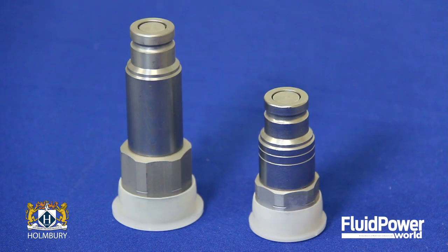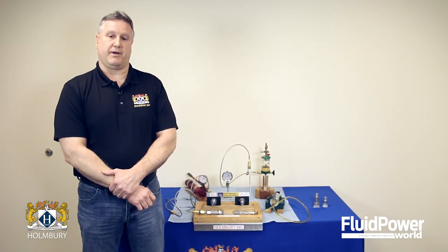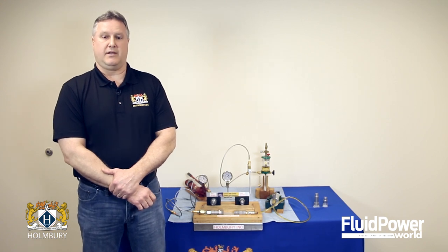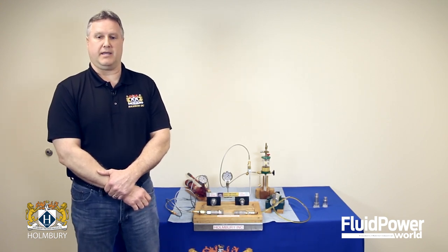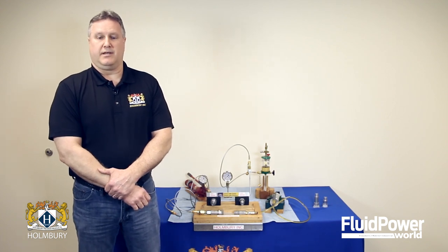As you can see, the HCP series male coupling is slightly longer than the standard HQ series male coupling to incorporate a built-in relief valve that transfers the trap pressure from one line to the other when connection to the female coupling is made. The hose line to the female will need to be at zero pressure to allow the HCP male to operate correctly.